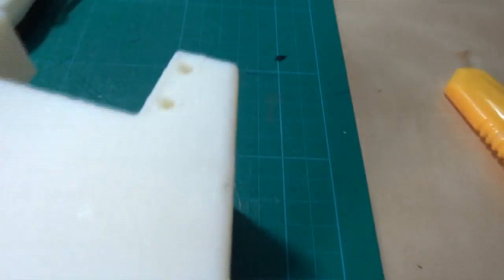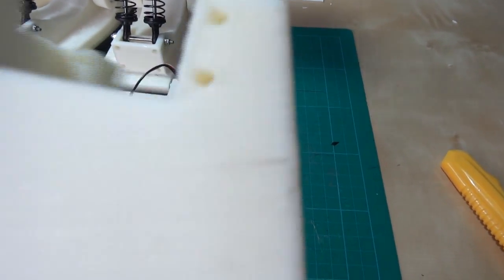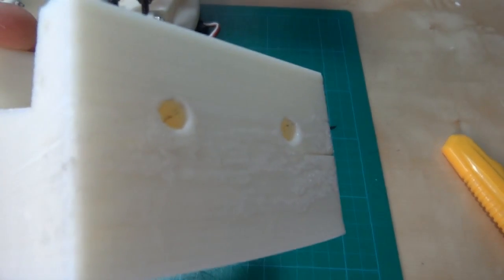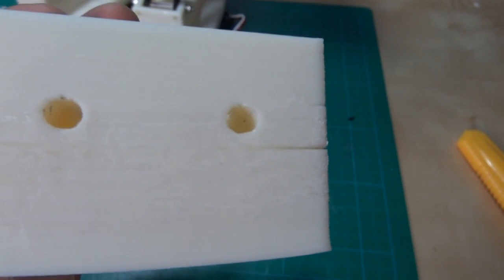That's mainly because of the shrinking — as the layers shrink it applies more and more pressure, and it also lifted off the bed on one corner quite badly. Mechanically it's fine; all of the fixing centres are in the right place. But I'm going to try and patch those splits up.